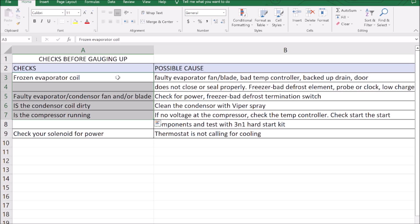Sometimes on these little compressors, you may get like 1.3 amps for 10 seconds, then out of nowhere it'll drop down to like 1.02 amps for about 2-3 seconds, and you'll see your pressures come down. What's actually happening is the compressor has stopped pumping. So even though you have amp draw and it matches the rating plate, it does not mean it's correct. We need consistent amp draw. If we have 1.23 amps, we need to stay there — we can't have it dropping off after 5, 10, 15, 20 seconds.